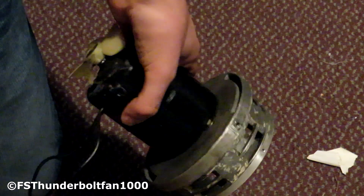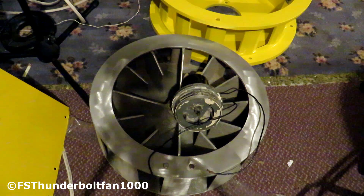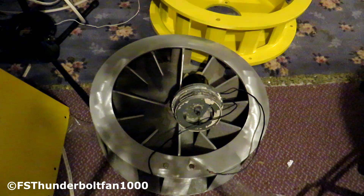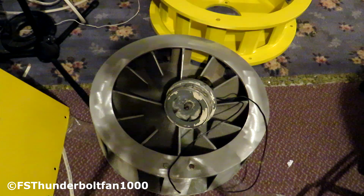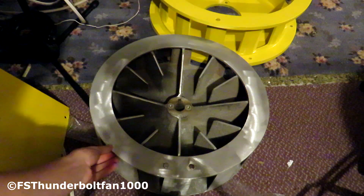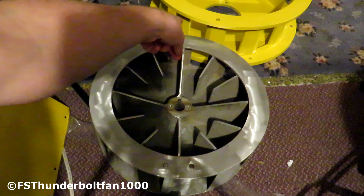Let's move on to what's inside an actual tornado or air raid siren. Before we get into the Thunderbolt — the most common tornado siren everyone knows about — what we have in front of us is a Federal Signal 500 SHST siren rotor, and in the back is the stator, that yellow thing right there. It's basically a super-sized Model A. This siren has about a three-quarter horsepower motor; the 500 takes a 10 horsepower motor. The rotor goes inside the stator, spins really fast just like on the Model A, and spits the air out the ports which then get chopped by the stator.